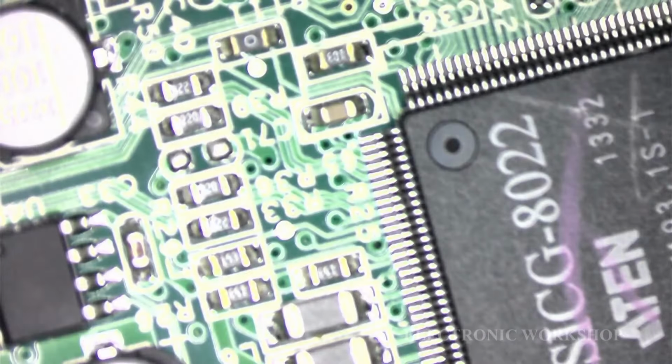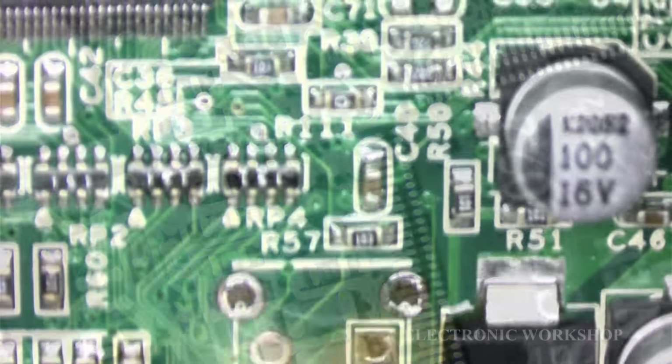Let's clean that up and see did we get the solder out of the holes. I think we have a little bit of solder in this hole here. But the rest of them, I think, are clear. But now it could be flux inside it as well. We can find out. We'll have a look now. See, can we get more out?